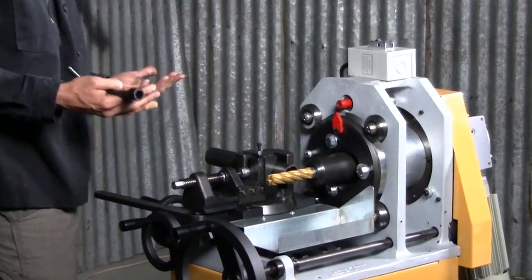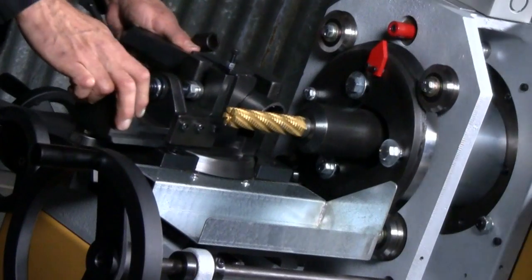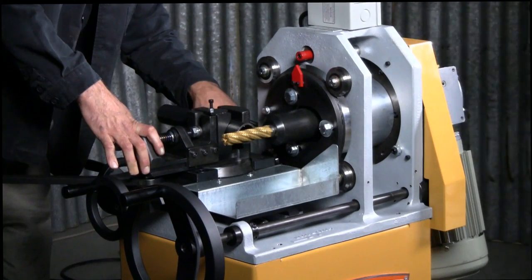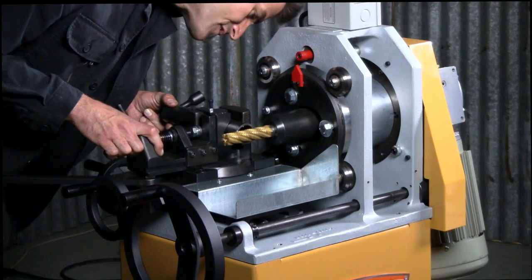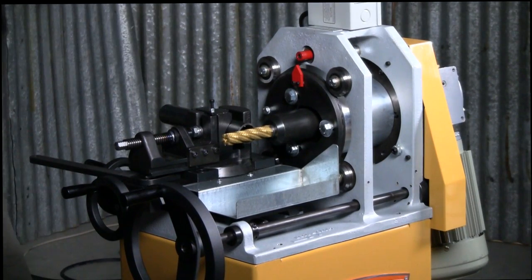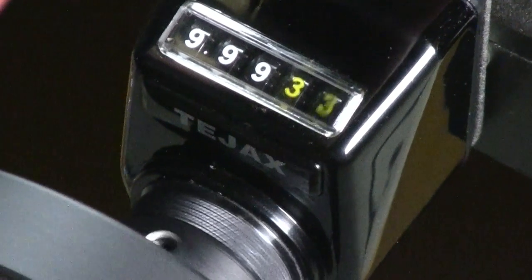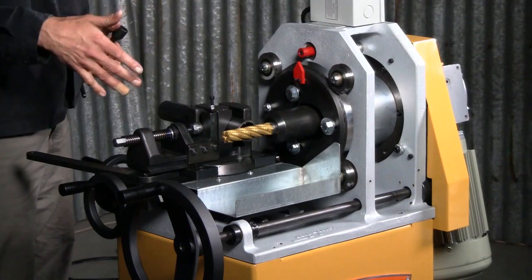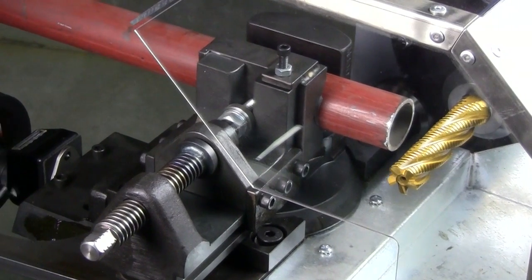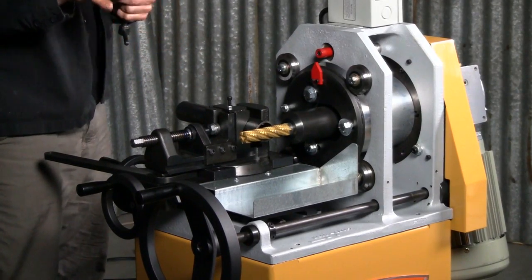The other thing that this will do compared to, let's say you want to notch on a regular mill like a vertical mill, is that it has a normal cam lock and you can set your degrees. You can spin it either direction and add a little bit of angle really quick. There's a degree finder on the side, so let's go ahead and set it at five, just for the heck of it. Lock that down. If you need more adjustment, on the back side you've got a decimal finder so you can spin it around to zero. Go ahead and do your notch, and if you need to come back — that's really the big advantage of this tool. You've got a notch, you can sneak your way up and you don't ruin as many tubes, and you get a much tighter fit. Every time you get a tighter fit, you get a better weld and you get more strength.